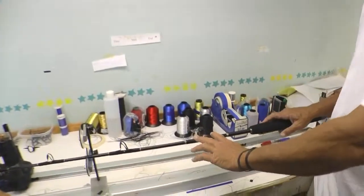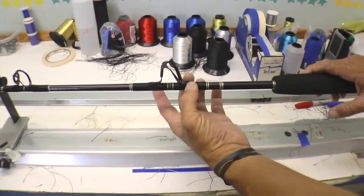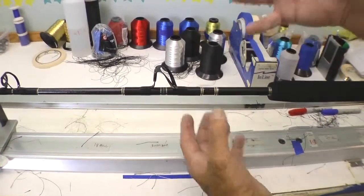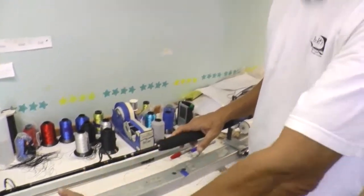Depending on the rod, the overwraps, which you just saw the underwrap go, the overwraps, there's going to be 2, 3, and sometimes even a 4th wrap, especially on your 80s, your 130s, or your unlimiteds. And then we do multiple layers of epoxy to really compress and help keep the guides tight on the rods. Being wrapped too loosely or not tight enough, you're going to compromise and the guides will start to loosen up over time where that rod is under so much pressure like that.